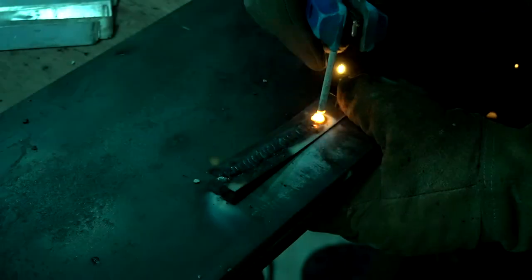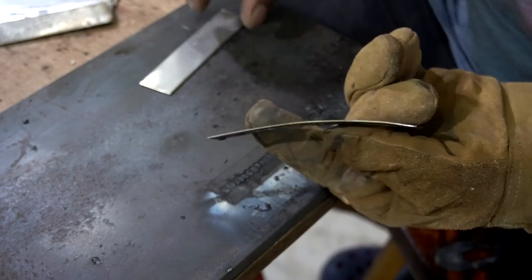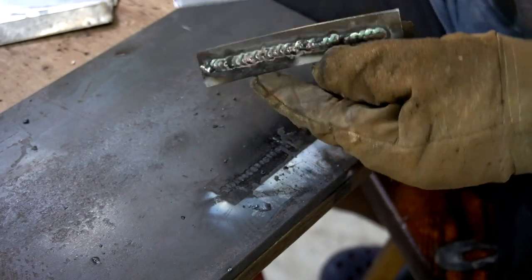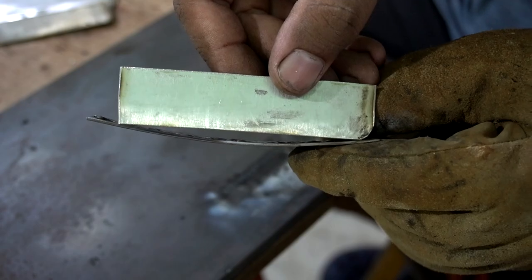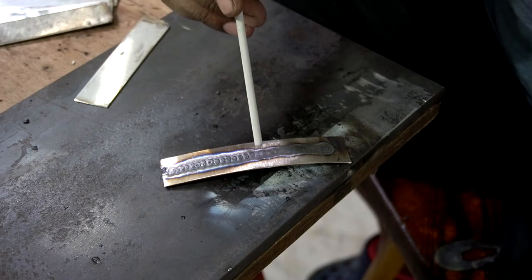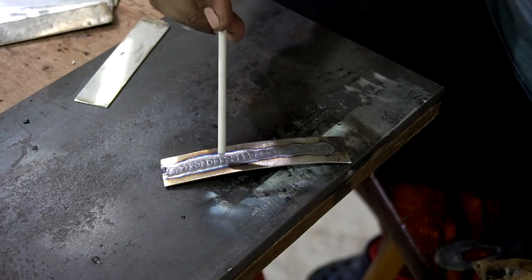During the welding you can clearly see that the material starts to warp, and this is because the weld, when it cools down, tries to contract. You can see how much this strip is going to warp, and surely you are able to avoid this by clamping your workpiece. And at the back side you can clearly see the impression of those weld beads, and if you stay for a slightly longer time, then there will be a hole at the back.